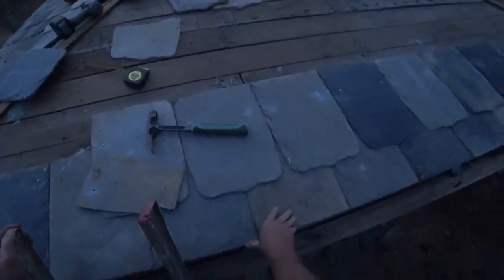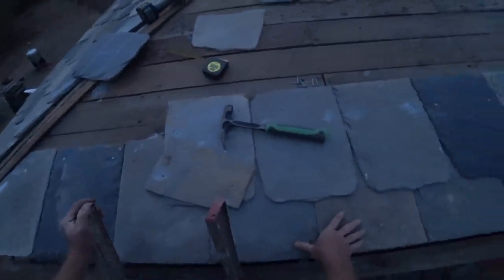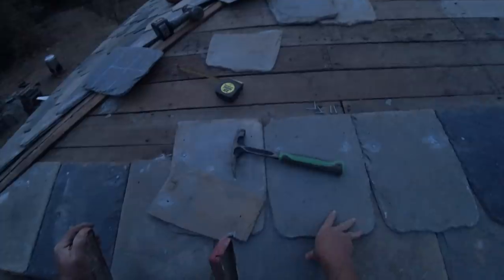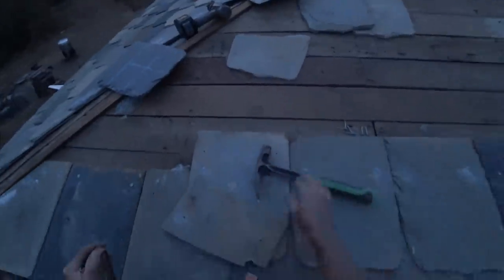It doesn't look like much, but this is the most persnickety part of the job - it just takes a long time to get these first courses laid out really well. It should proceed reasonably fast now since I have most of the slates cut. But there's just a lot of dealing with messed up slates and going to look for stuff. When I go to look for small pieces for corners I don't like to waste slate, so I look through all the broken piles - that saves a lot of slate versus just grabbing a perfectly good large slate and chopping off a corner.